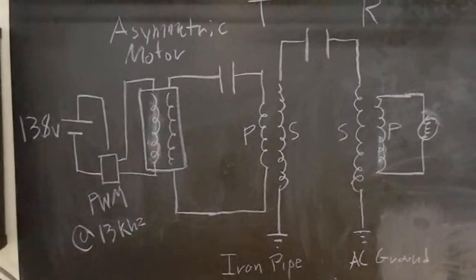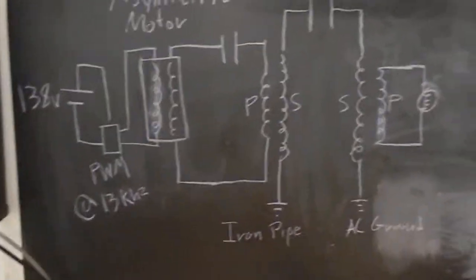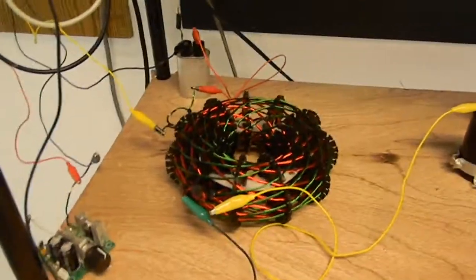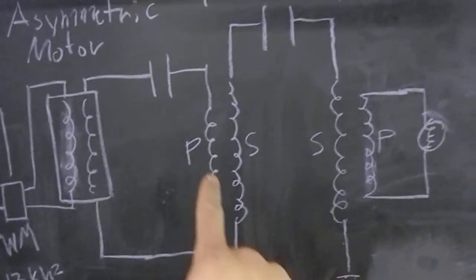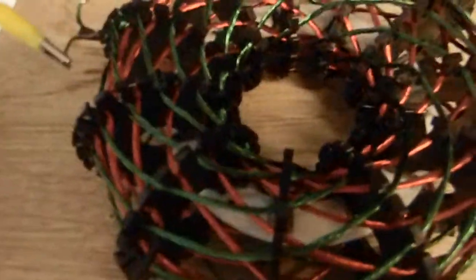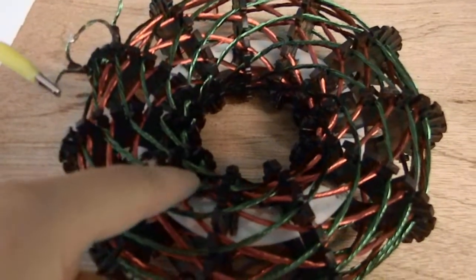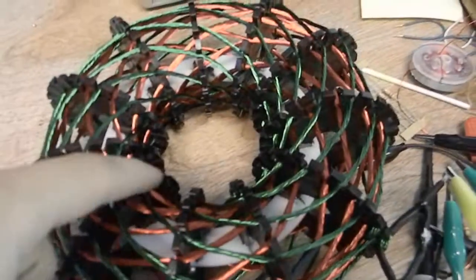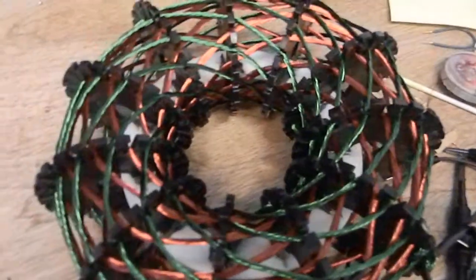Today I wanted to show that I have now separated my transmitter and receiver into different coils that are a little bit smaller. What we want to pay attention to is the winding and how they're in opposite correlation. On my transmitter, the primary is going counter-clockwise and down. And on my receiving end, the primary is going clockwise and down. If you flip it over, it looks the same.